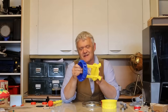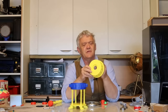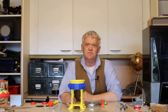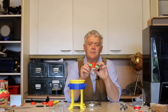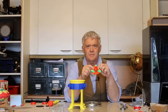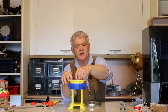It puts together really easily. In there is a thrust bearing at 47x25mm, and it sits there because that is the main bit that's going to rotate. You can see it's got holes in it to take the magnets, and it sits nicely on that thrust bearing so when we spin it, it spins nice and freely. The drive mechanism is this clutch plate here — the only thing to remember is to get it the right way around. When you look at the clutch plate you'll see a little red projection; the green projection goes onto the red because that's the way the clutch works. Then drop another identical thrust bearing into the recess in the centre and put the clutch plate in.